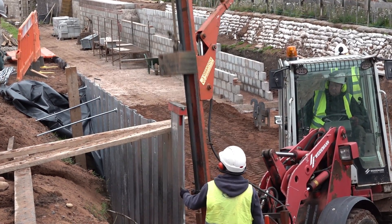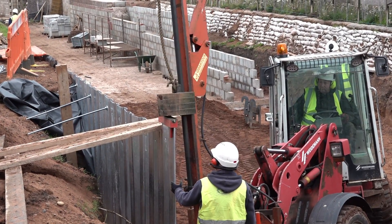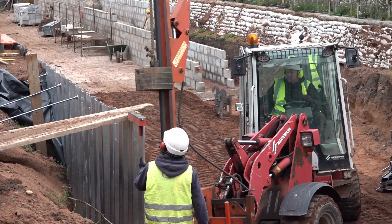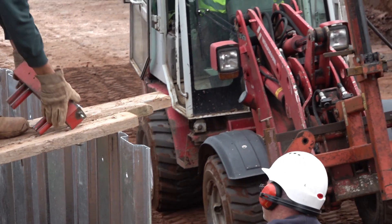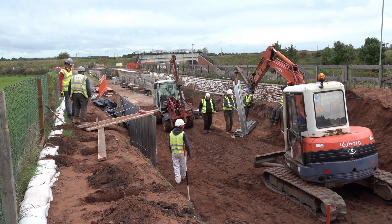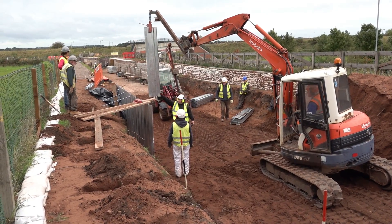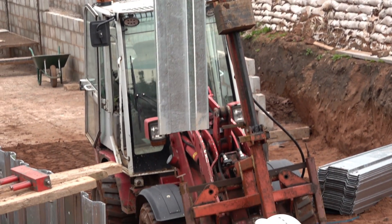You can see all that works is just a hydraulic ram in there which flicks a rod when he's working that from inside. It's not that heavy but very, very simple — very, very crude — but it really works. If you wanted to drive it almost fully into the ground you could, all the way down. You might find by the time you've driven it down the top of the pile looks a bit bent and manky, but that's what the dolly — the helmet — sits on the top for. As Steve said, he could make one of those, but he said it'll last a day and fall apart — these things are a massive block of steel. The quick release and the helmet — we purchased those.